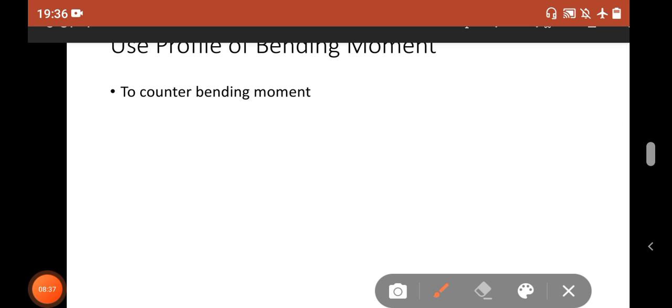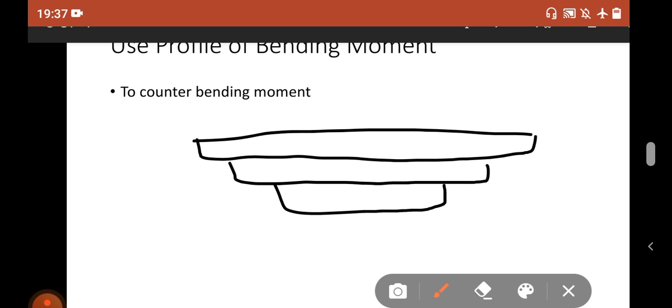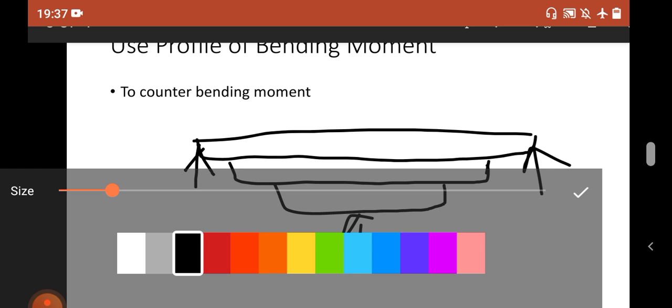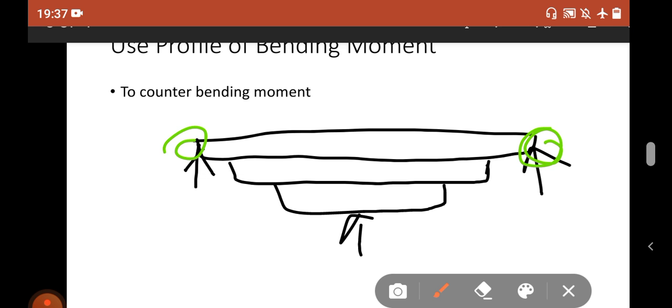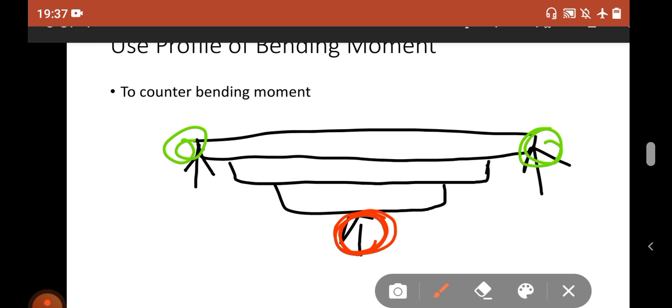You need to provide a section that varies just like this — your section looks like this tapered shape. The support is here and here, and the load is applied at the middle. Going back to the leaf spring: the supports were at two ends and the point load is at the center. So now it is clear to you why the leaf spring looks like this and why it is a perfect example for understanding simply supported beams. Thanks for watching — if you like this video don't forget to share it and leave a comment.